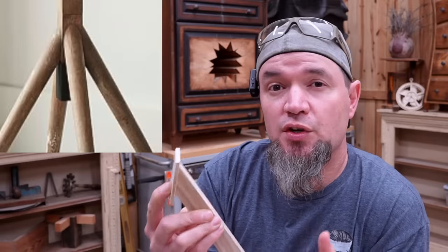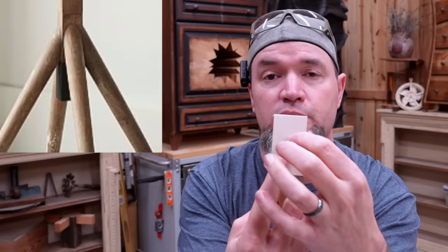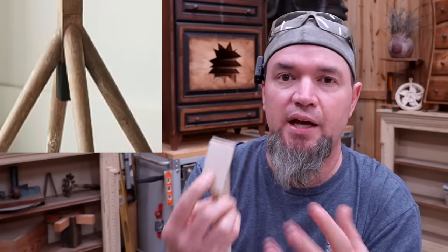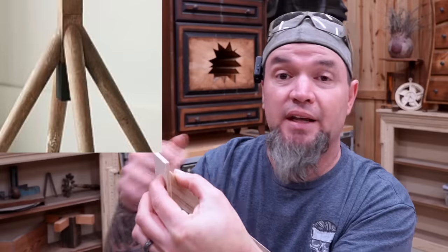Now with the angles cut on all our legs, how are we going to attach these to our two by two? If you look close at where the legs attach to the two by two, it almost looks like it's a little thicker at the bottom, like it's designed into the base — but it's not. All they've done is taken a quarter-inch piece of plywood that is the same width as the board — two inches — taken the 50-degree angle, and attached it just like that. By doing it this way, it keeps you from having to install any screws or nails at an angle; you can do it all from the back. I would throw on some wood glue, pre-drill, and put two screws in — that's going to make for a really solid leg. This piece of plywood adds extra surface for glue. Once you have that installed, coat it with glue, measure up about four inches from the bottom of your center board, and attach it using wood glue and some brad nails. Once that wood glue dries, you're set, and then just repeat for the other three legs.